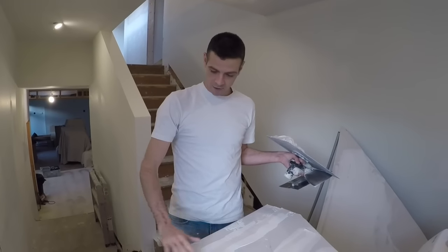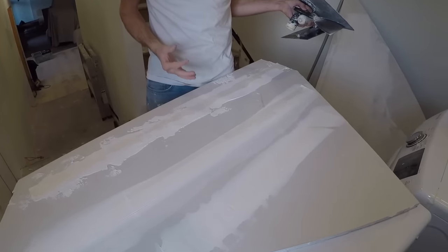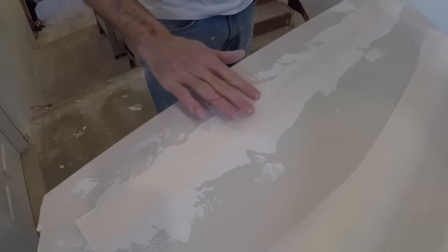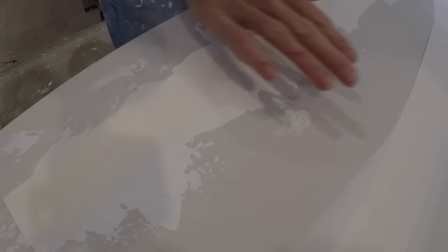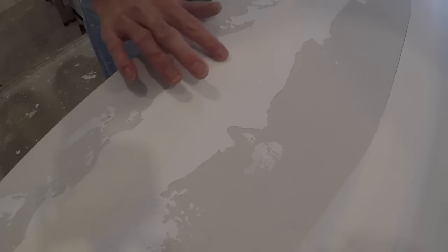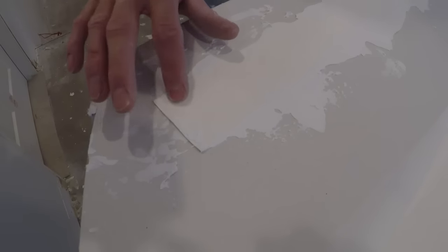Okay, so we've got our dry, bubbly tape — I had to try pretty hard to get these blisters. Let's get up real close here and listen to what it sounds like. You can hear when there's a blister. Let's listen to this one first — it all sounds the same here. But when you get over here there's a hollow sound; you can hear there's a blister. It sounds like that, right?